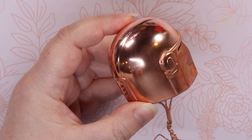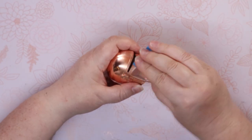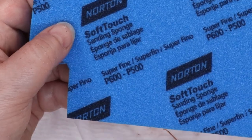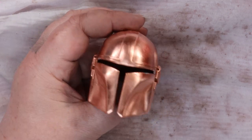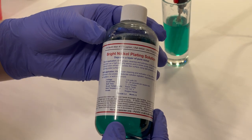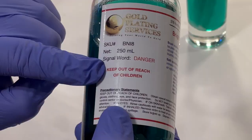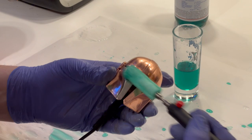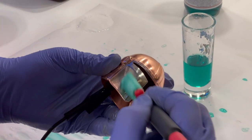Now, the pieces should come out of the bath looking like the top of the helmet. But because we were still dialing in our tools and techniques, we did get quite a few pieces that looked like the bottom. We were able to polish them up using finer and finer grits of sandpaper. Of course, we all know Beskar is silver-colored, not copper. So we pulled out an electroplating pen and some nickel plating solution, then attached our electric cables from the rectifier to our armor and essentially painted the nickel on.